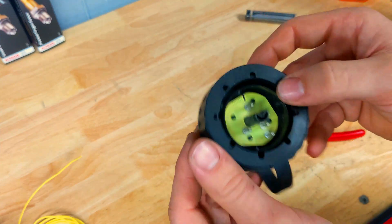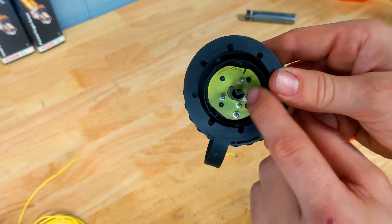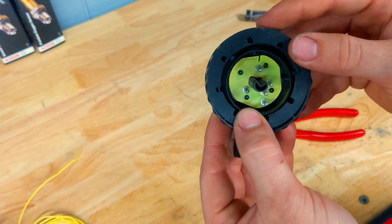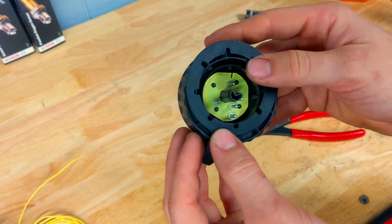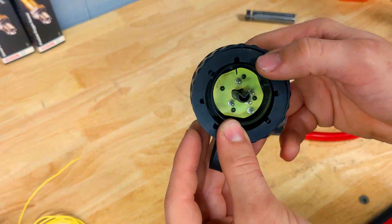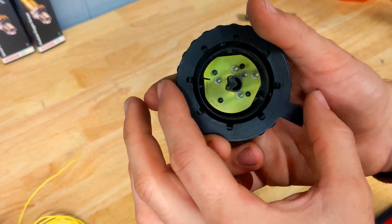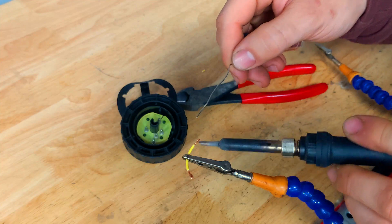Inside the 32-pin connector we're going to have to join pins 17 and 20 — those are the two pins that are the furthest apart. We're going to bridge around the board to create a permanent connection between these two points. You could also wrap wire temporarily if needed, but using solder ensures the connection won't corrode, weaken, or shift over time. Let's go ahead and pre-solder the ends so they have a little bit of flux and solder on them.